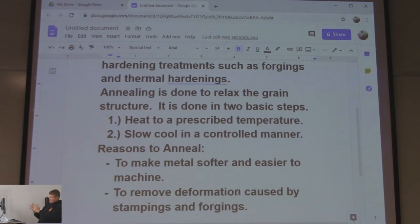If you wanted it not to break, you would anneal it — heat it up, let the structure go where it needs to go to make it not brittle. You're also work hardening it from stamping: compressing metal on one side, intense stress on the other, plus torsion. Then let it vibrate for ten years — it's going to break eventually.